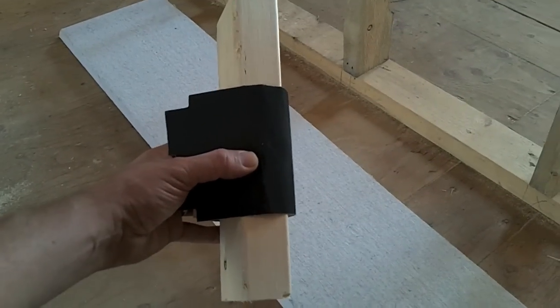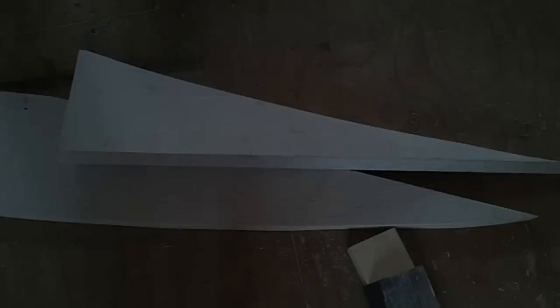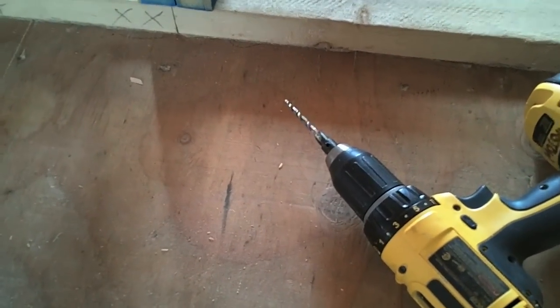So we're putting our fascia together here. We've actually got a curved piece cut out of a 2x12, so we'll bookend these pieces. We only need to use two pieces and what I'm doing is we've got a rough cut and I'm using a block sander to take all the high spots out so that curve is perfect. These are the details that you don't want to mess up, so we'll make it perfect and show you when it's done. We've got this piece smoothed out — you can see the radius on there is perfect and we've got this piece ready to laminate. We're actually going to criss-cross this piece so the glue has something to bite on. Then we're going to drill some pilot holes and countersink them, put some screws in, and then we'll put some pocket screws in the back to hold it together so it never splits. The radius stays true and it doesn't look bad — this one's going to look perfect.